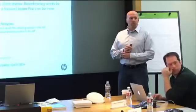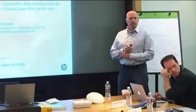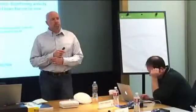But also, I think it's real important because all the other vendors we talked to talked about band steering. But I think everybody has their secret sauce. And being an engineer on the floor, when you're troubleshooting something, it's really important to understand exactly what that vendor's secret sauce is, so it's easier to interpret an issue if it truly is an issue. I don't necessarily believe that band steering is for everyone. I think it might fit a special need, or maybe you have a high congregation of clients and you're trying to manage them back. And to your point, that's typically where we recommend using band steering.